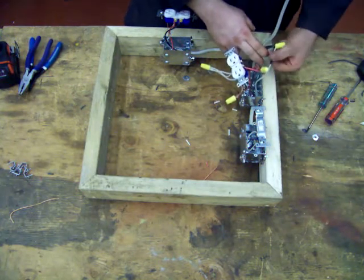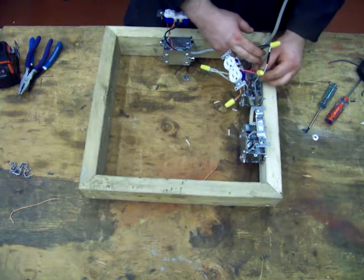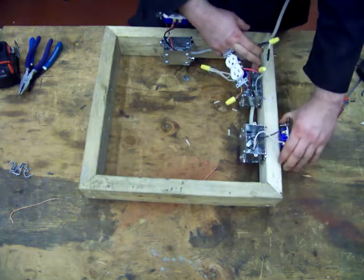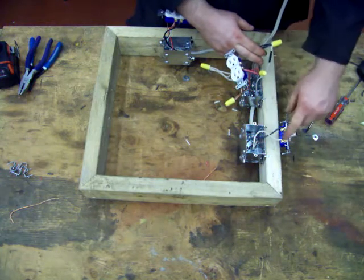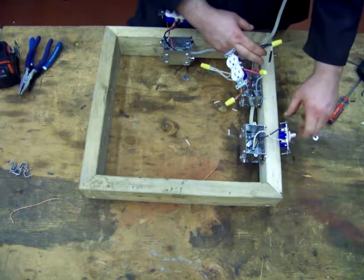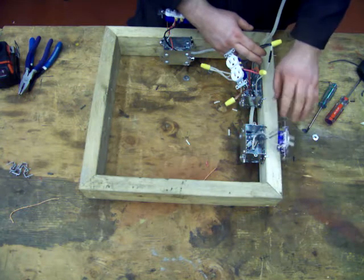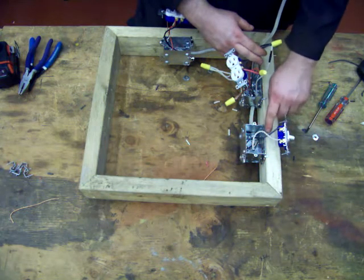It also sends power through this wire. It's marked with black tape. It's called the switch leg, and it goes up into this box to our switch. Right, comes to the top. When you turn the switch on, power then comes down to the bottom, and it has to be this way for code. They expect to see it.